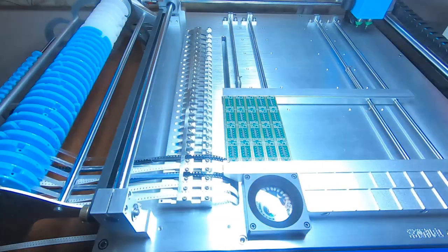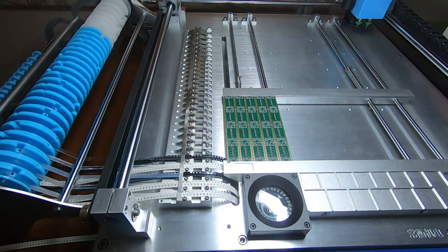So it's finished its run - that's 480 components in about 12 minutes, so an average placement speed of around 2200 components per hour. As I said in a previous video, I've actually slowed this machine down because the bench it's currently on is not really suitable. So what we'll do now is remove the board from the machine, get it onto the reflow oven, and then have a look at it under the microscope. I've now run 22 of these particular pallets - a 4x5 board design - so that's pretty much 11,000 components and it hasn't missed a single one. None of the boards on the pallets have failed; they've all been successfully reflowed and the soldering and component placement was good.